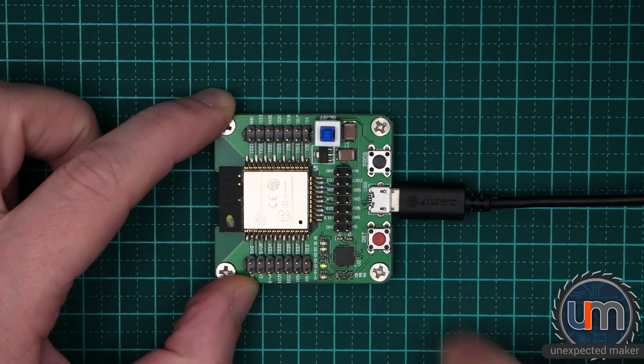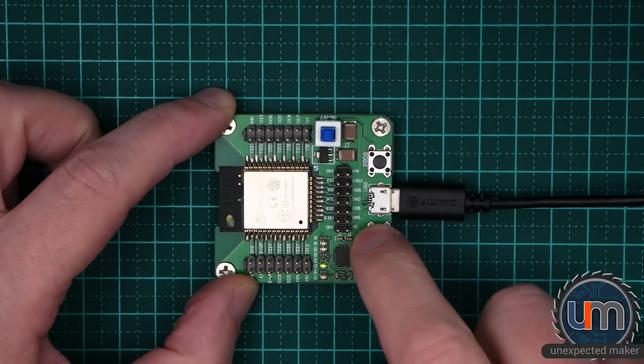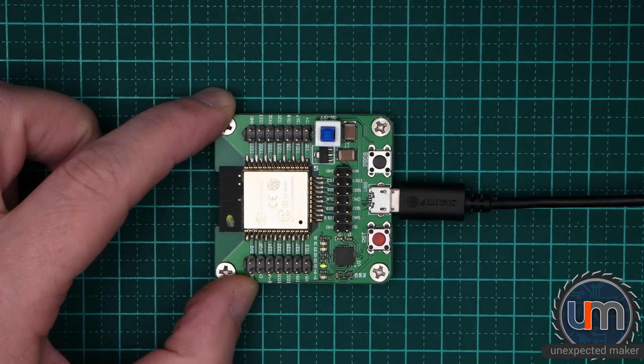Because there's no auto reset I also have to hit the reset button to have it start up. I'm looking at my console right now and it's definitely started up, but there's no flashing LEDs. It looks like they haven't broken out an LED onto pin 13, which is not mandatory, but flashing an LED with a blink sketch is the hello world of microcontrollers — the way to check whether they work or not. Let me just try a reset again just to see — definitely nothing flashing.